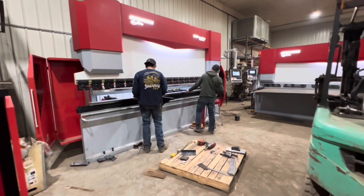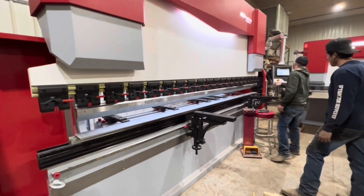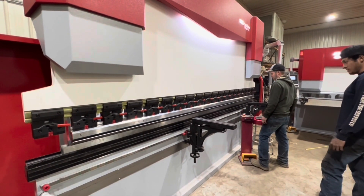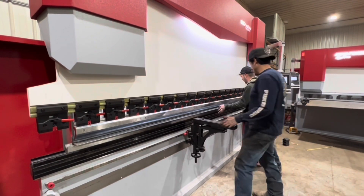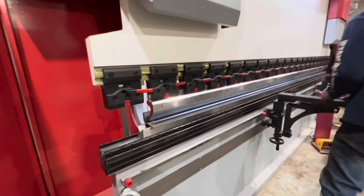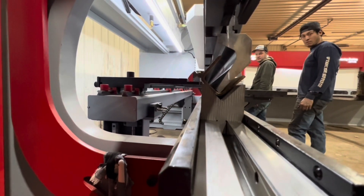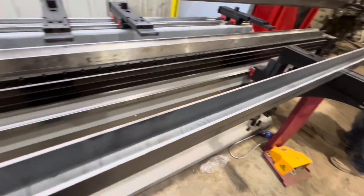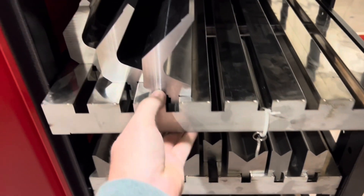One of the things that happens when you buy a new brake is you almost always immediately run into the limitations of stock tooling. Joe was smart enough when he ordered this brake — we added a gooseneck punch. Gooseneck punches give you a lot of flexibility with regard to how tight a bend you can make. Like making this channel right here — you could not make this with a straight punch that comes in the machine. You can see the relief where the channel can fold back up on itself. After some correction and rebending, it really tightened up and made it perfect, and the guys went ahead and bent four or five more while we were on that.